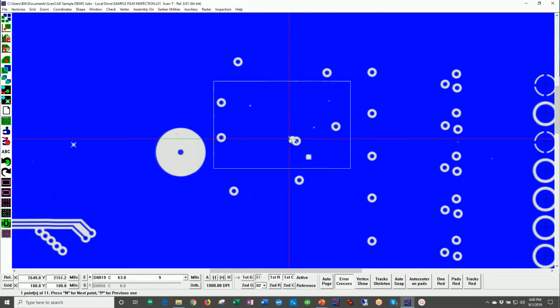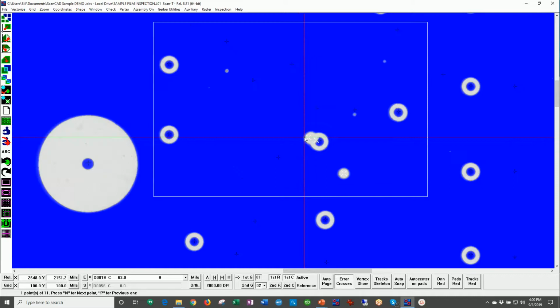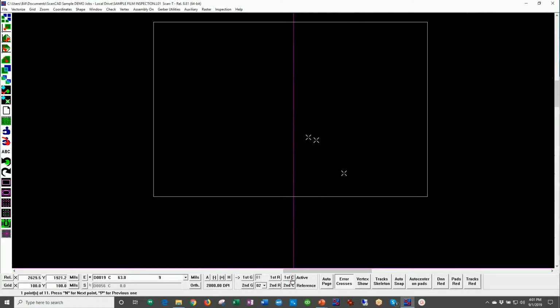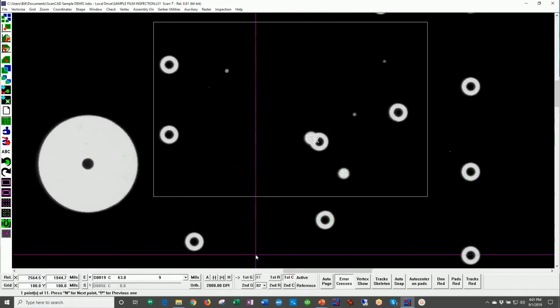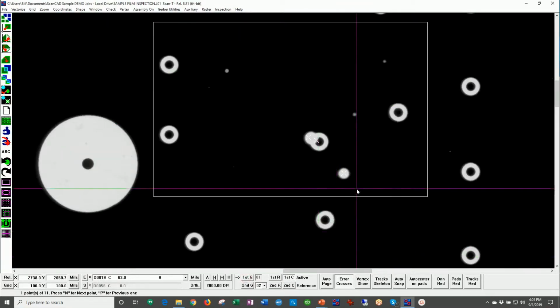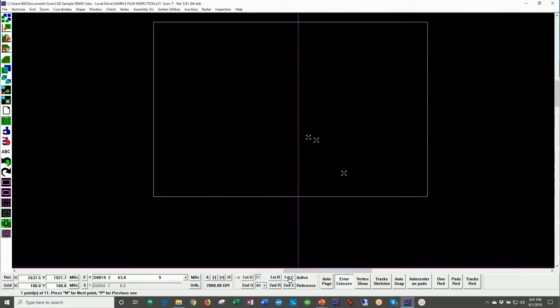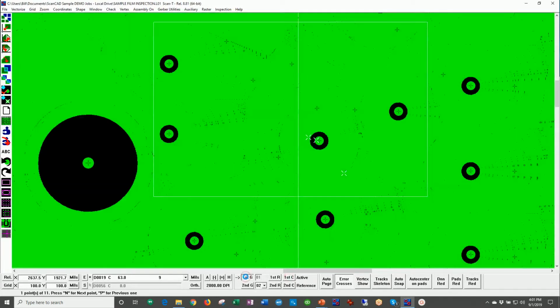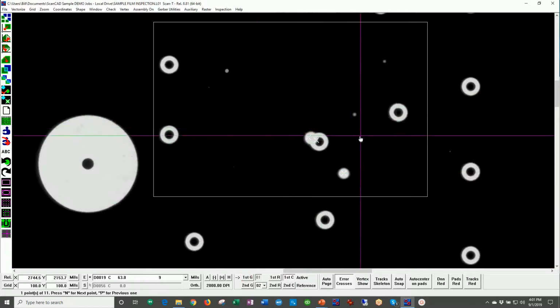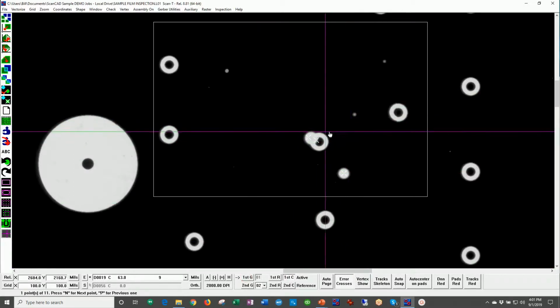And right away, in this one area of the film, I want to show this to you. Let's turn this off. We're looking here and it flagged 3 errors in here as compared to CAD data. So basically we have 3 errors in here where the CAD data indicates there should not have been any kind of openings, and yet we see openings, okay? Now also you'll notice that there are some other errors, but those are smaller than 2 mil.